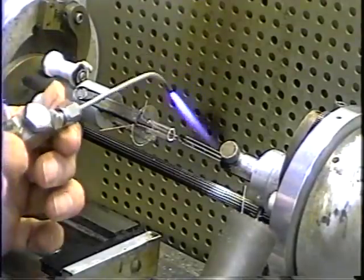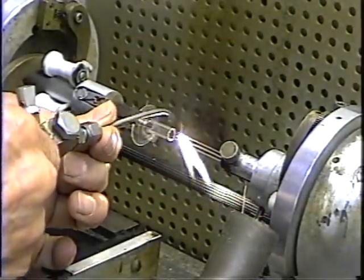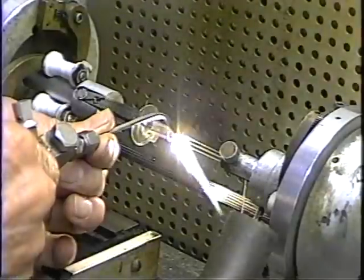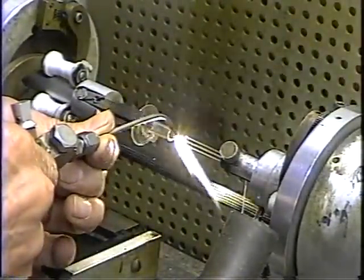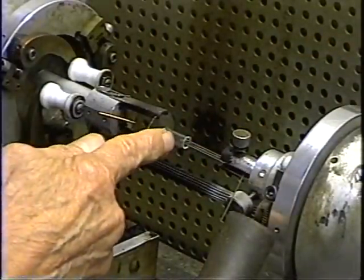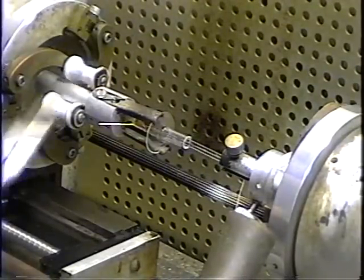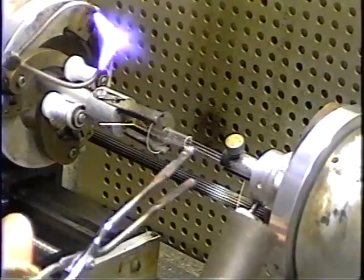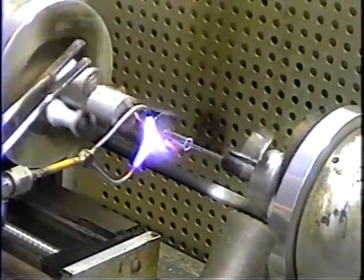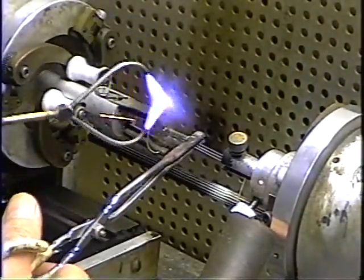We're going to go ahead and drive the air out of the tungsten first, just like we did before with the filament ones. That looks good — I've got about an eighth of an inch up into the end of the flare. The lathe holds them perfectly aligned; it would be almost impossible to do this without the lathe. I'm going to preheat this a little bit. We don't have to preheat Pyrex a lot — we just play the torch on it a little until it starts to flare, and that's enough. If it was soft glass, you'd have to be pretty careful.